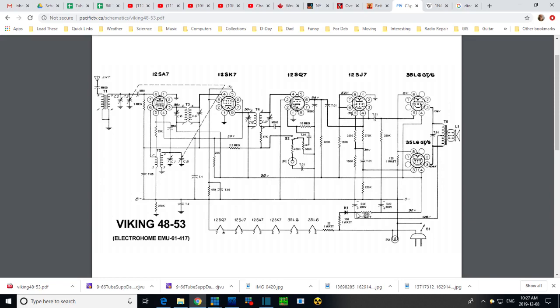But here there's a pretty strong hum. But here there isn't. Here there sure is. And this is going straight out. So is that capacitor no good? Why so hummy right here? So it's supposed to be a 50, and there's a 40 in there. I could boost this capacitor, and we'll see if that hum goes away. I mean, that's the thing to do. Let's do that.